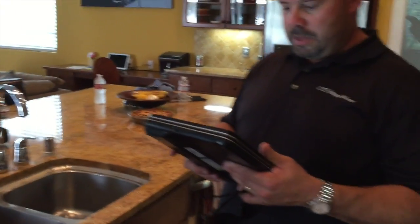Okay, and is that pretty much everything we've got? The last thing is in the attic, which I don't think we're going to go up again. In the attic, you have an exhaust vent pipe that goes from the laundry room exhaust fan. That vent pipe is required to vent to the exterior so that the exhaust fan doesn't pump moisture into your attic. And that vent pipe is laying on top of the insulation. So if it was mounted to a roof vent, then it has since fallen. What they'll do is take a little metal strip, wrap it around the pipe, and screw it into a truss right adjacent to the roof vent. It's just one of the exhaust vent pipes laying on the insulation. Okay, great. And that's it.